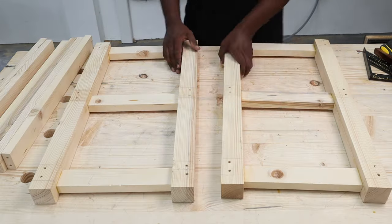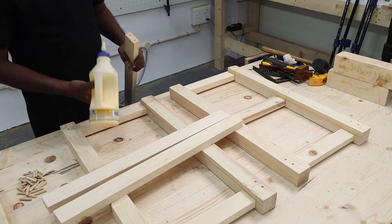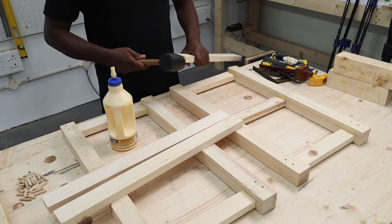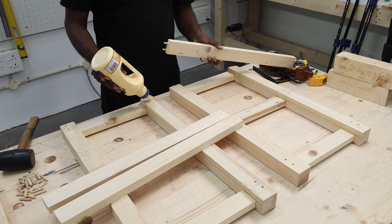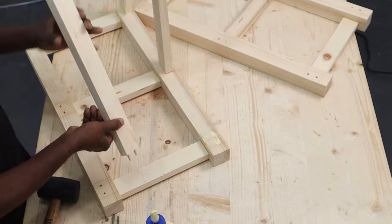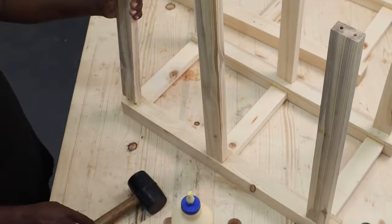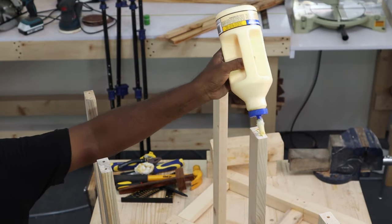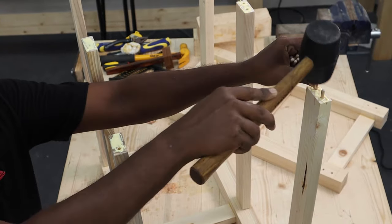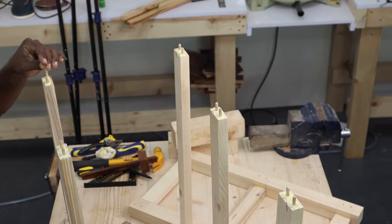These will be the two legs for our bar cart. We now had to join the longer bracing pieces to the legs on both sides. We had already done the drilling of the dowel holes for the longer bracing pieces earlier, so we repeated the earlier process and used wood glue and dowel pins to join all six longer bracing pieces to each leg using dowel joinery. After filling the holes with wood glue, we drove the dowel pins into the drill holes using a mallet.